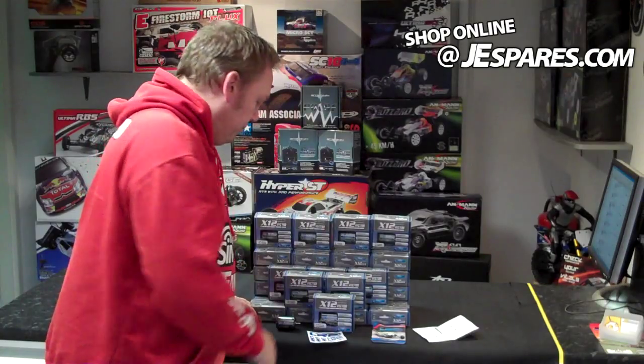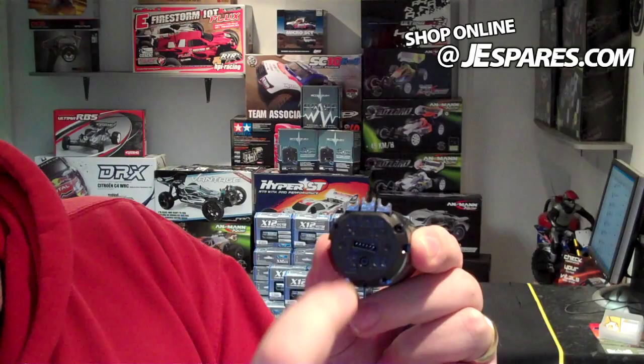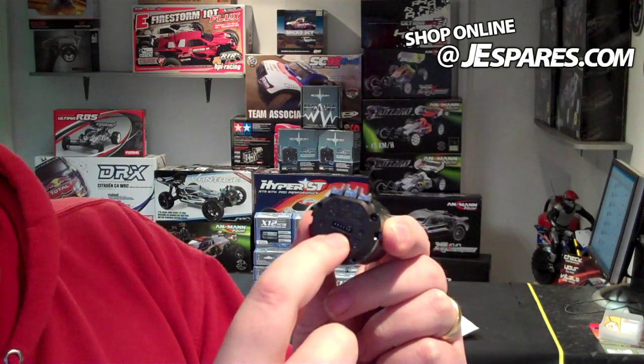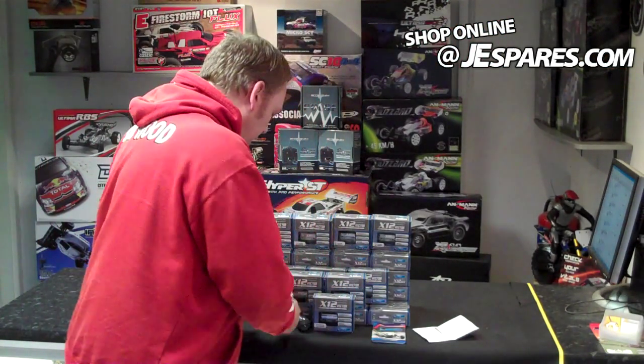Another good feature is the timing of these motors. I don't want to get too close because it starts getting blurred. You see on the end there, where the sensor lead goes in, you'll notice that it's at an angle. Now, underneath here, there's a few little dots, and that tells you in the instructions what the timing is. You can change them — you take the endbell off and change it with these little inserts. They are quite small, I do apologise. That changes the timing at the end of the motor.